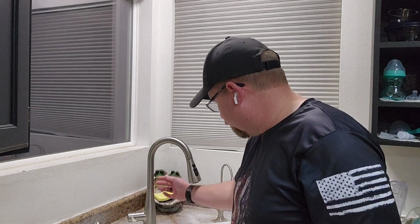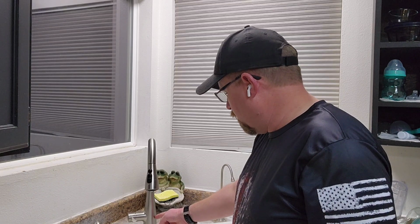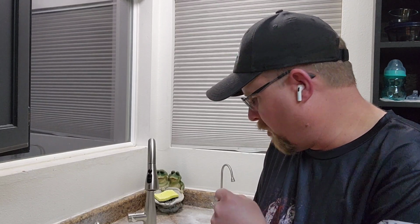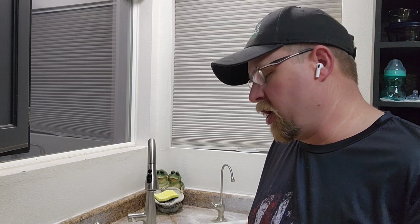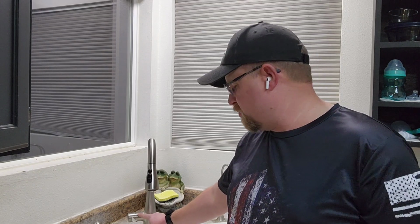And I've seen other videos where some of the guys were able to take the hoses from the inside and unthread them. That is not an option with this newer one. I think they've got some kind of a quick disconnect inside there. It's some kind of a mechanism, and I'm not sure how to operate those. And it wouldn't have mattered anyway, because all of that junk was up in this mixing valve in the handle. So even removing those hoses from the bottom wouldn't have done any good anyway.